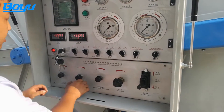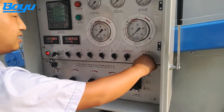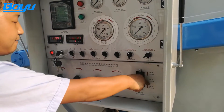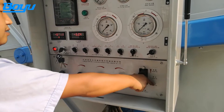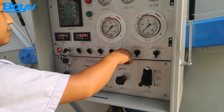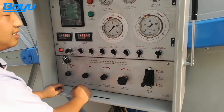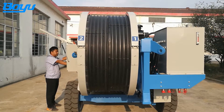Tighten the two wheel tension adjusting knob and adjust the engine speed to 1800 to 2000 RPMs. For the drawing of wheel 2, place the braking handle to the position of release and the reversing switch number 2 to the position of pulling, then place the handle to the drawing position to start the traction.